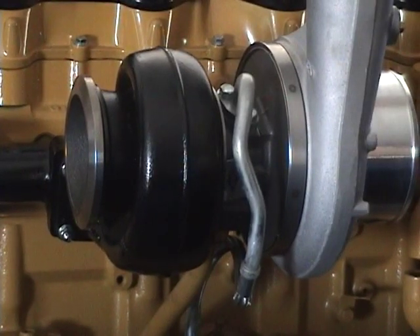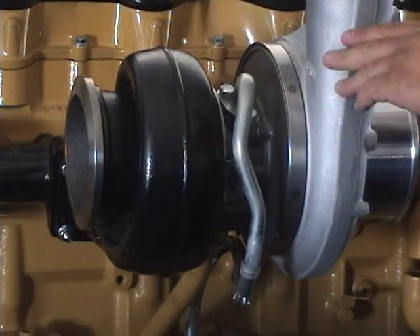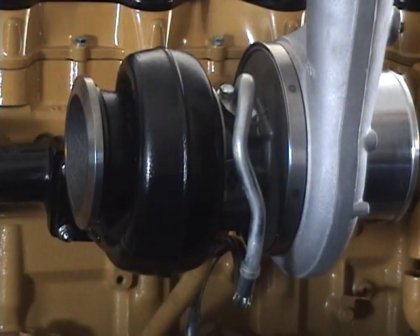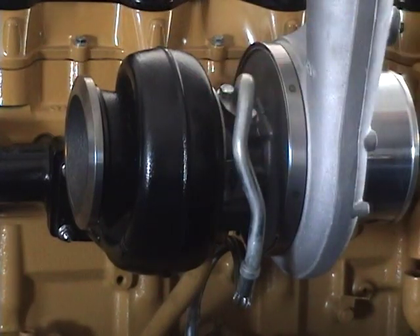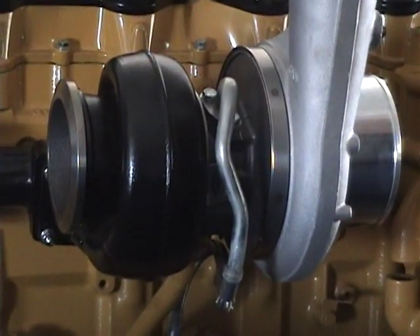You're looking at a Caterpillar E model. This is our Big Boss Stage 1 turbo. The advantage of this turbo is it will work on any stock application, anywhere up to a 725 horsepower application. We've machined a tighter exhaust housing that allows for a quicker spool so you get off the bottom a lot faster — it helps with fuel economy. This turbo will drop anywhere from 150 to 200 degrees on your pyrometer.